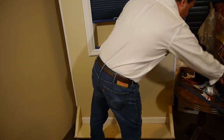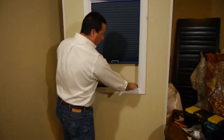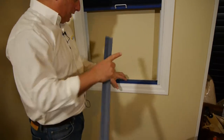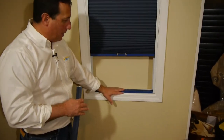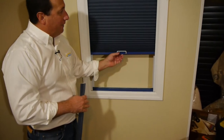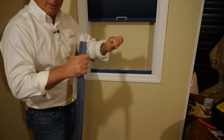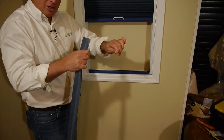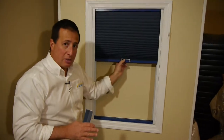Before we do the final step of inserting the cover in the bottom rail to hide all the hardware, there are some adjustments. You'll notice there's a little spring in the bottom rail — this spring sets the tension so the shade doesn't come sliding down on its own. If it feels loose and isn't staying in place when you move it, expand that spring a little bit. Tighten up on the rope attached to the spring and increase the tension until the shade slides smoothly but stays in place.